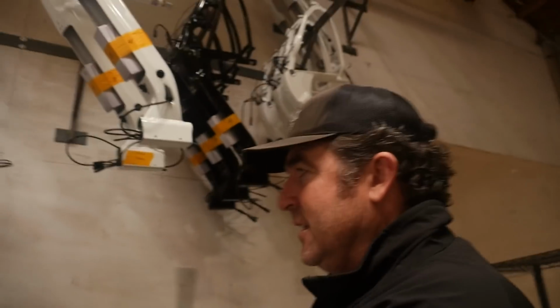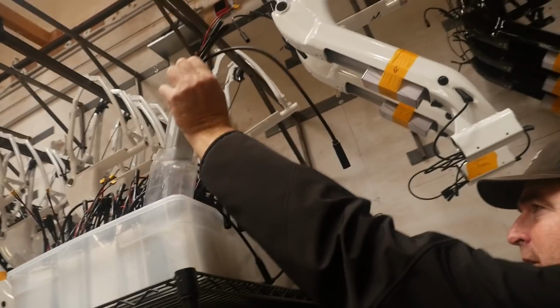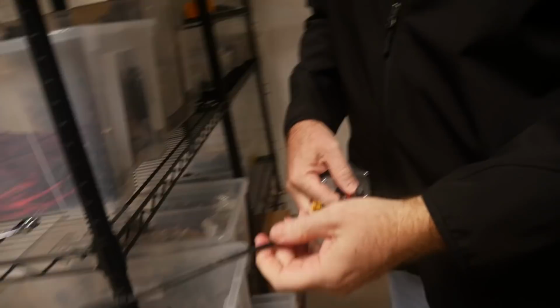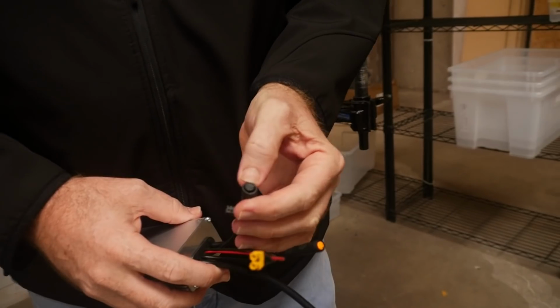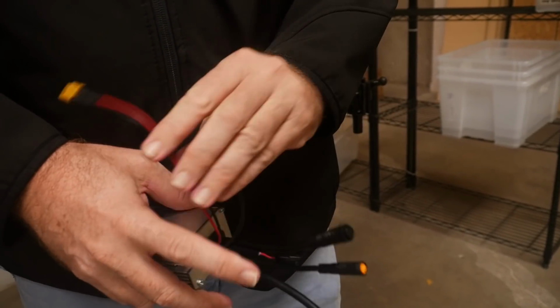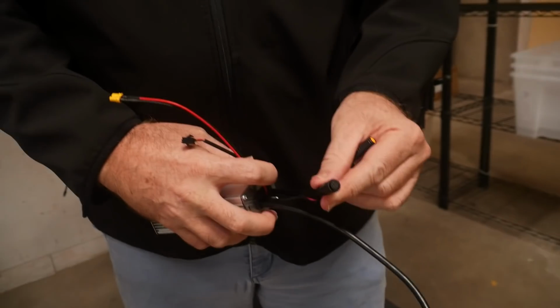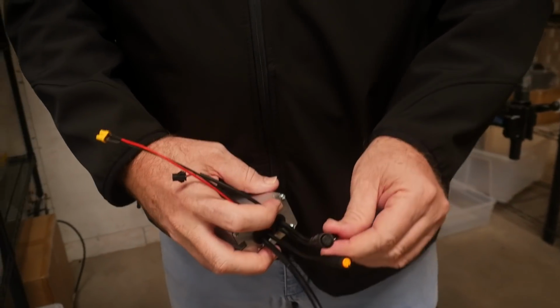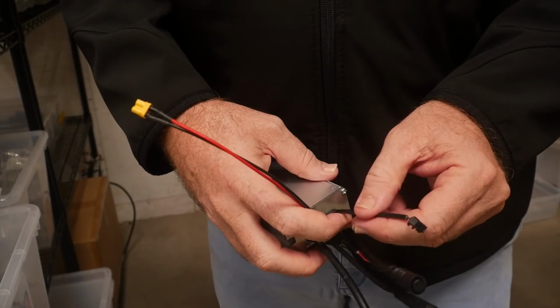Yeah. So each one of these are different models. It's really the same for the controller. The controller wiring inside here, of course, is vitally important, with the different lengths and the different pin call-outs. These all will be internally into the battery. These will be external. This will be the motor. This will be the fronts, and this will be the pedal assist. One will be alarm sensor, power to the battery, and then backlights.